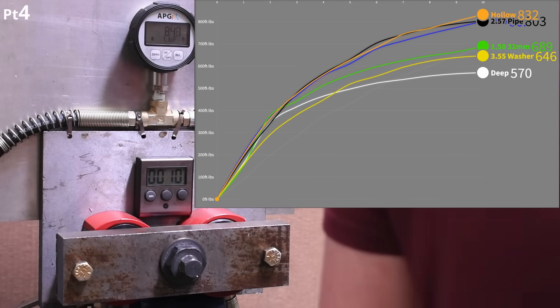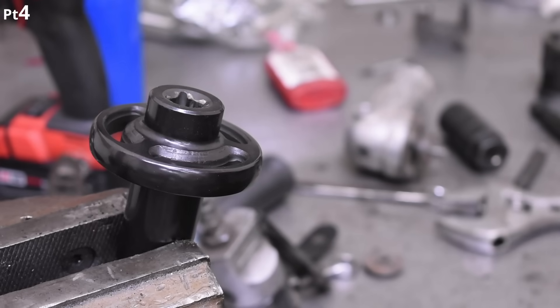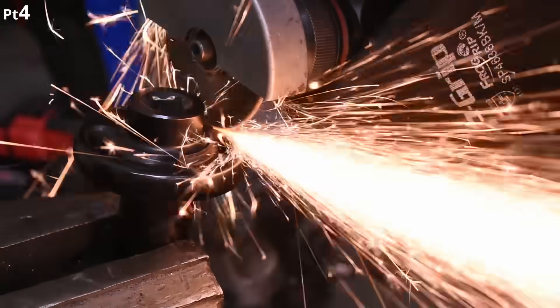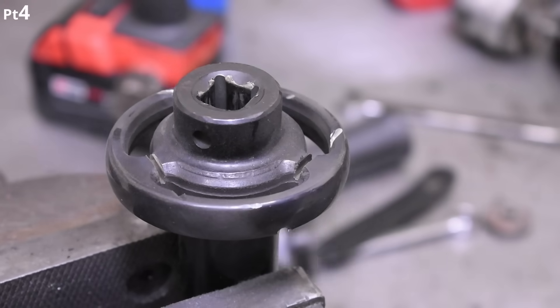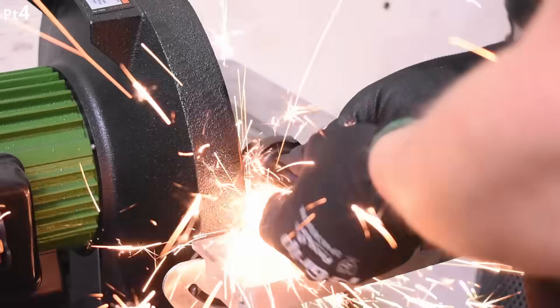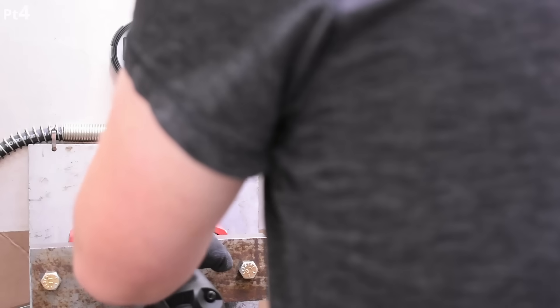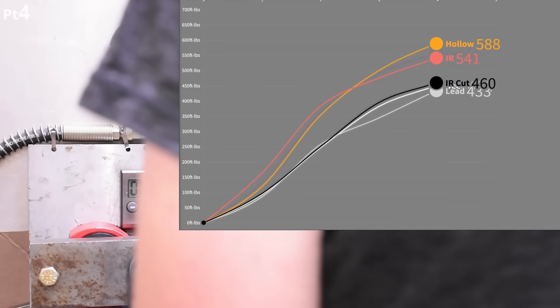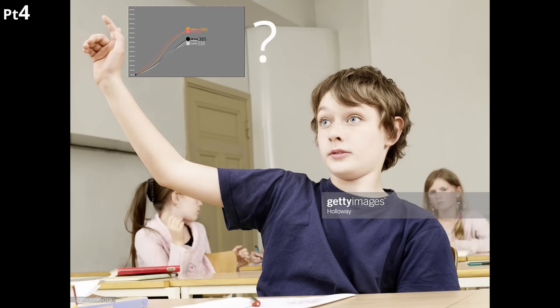But I had one last thing bothering me: what is this flywheel on the power socket doing if not storing any potential energy? It adds mass, which the professor says is bad, yet adds no additional rigidity. So I asked Dr. Bollock this question — it did conform to his explanation of forces at play — but we're more practical than theoretical type folks around here, so I just cut the flywheel off, leaving the thicker and thus more rigid socket mass intact, to see what happens. Less mass, so should be more oomph. Result: 536 foot-pounds — right after throwing the untainted power socket on the dyno and confirming it made 615. So I provided these results to the professor and pointed at them with a question mark, at which time he said he would get back to me tomorrow, then ghosted me for a few months.